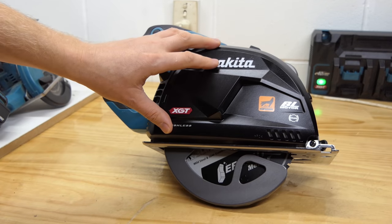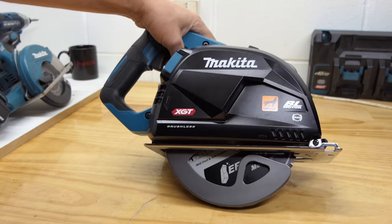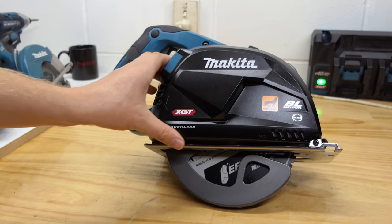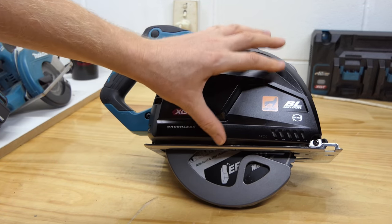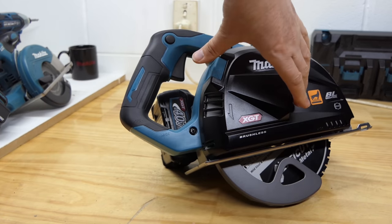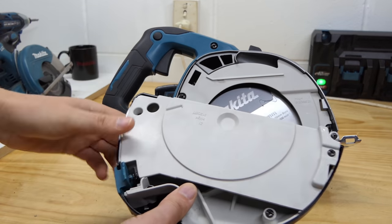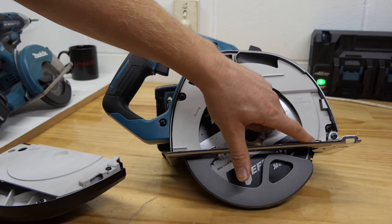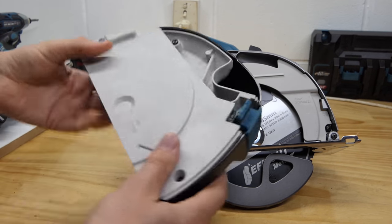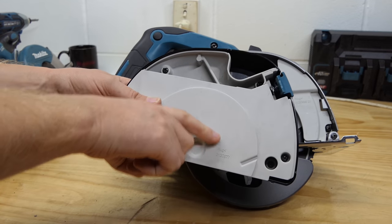A lot of people panic thinking this is made of plastic — the outside here is polycarbonate, and this cover is polycarbonate as well. They've gone straight to polycarbonate rather than PA6 with glass fibre, which is the best option in my opinion — the most impact-resistant. But the inside is not plastic. Put your hand here, finger on the trigger, and off it comes — the inside is made of magnesium. Your chip comes round and follows this path which curves into the top so the filings go inside and build up in here.